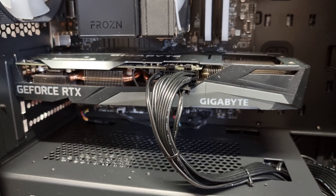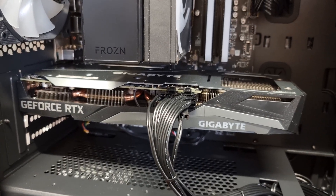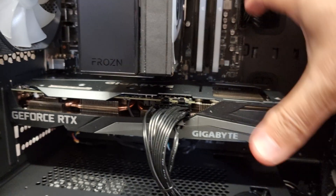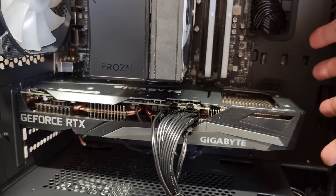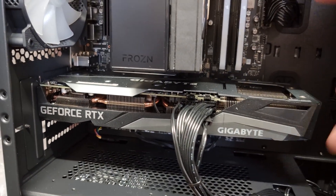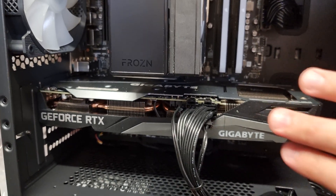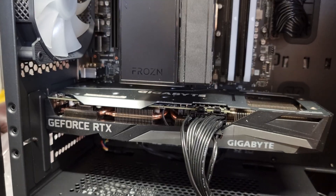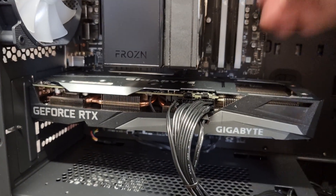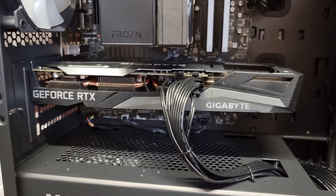That flex is going to cause cracked joints under your GPU core and under your memory pads close to the PCI slot. So when you're doing cable management or anything inside your case, please remove your graphics card first. Do your wiring, do everything — the GPU should be installed last. If it's an existing build, remove it anyway just to be safe so you don't keep bumping into it.